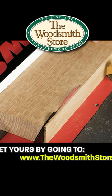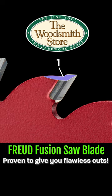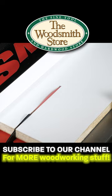And unlike other combination blades, you can cut melamine and laminates with this. It's a combination of three different angles on each tooth, ground to do a specific thing. That top bevel is 30 degrees — 30 degrees gets you an excellent cut in plywoods and melamines, which is quite a bit steeper than most combination blades.